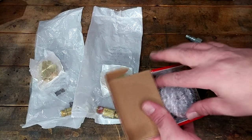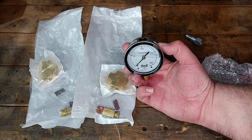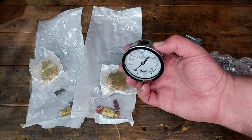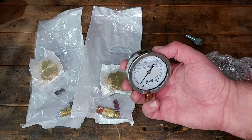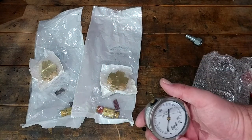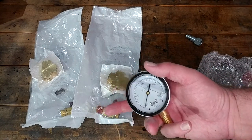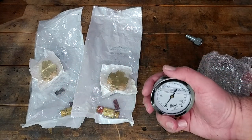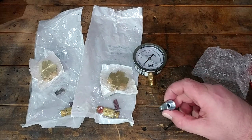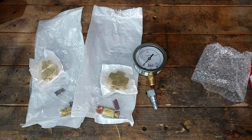The first thing I'm going to do is verify that our pressure gauge isn't lying to me. To do that I've got this completely swanky glycol-filled stainless steel gauge — 100% not necessary, but cheap stuff isn't cool and cool stuff isn't cheap. So if we're going to do it, we're going to do it. This one's good up to 200 psi, as is all this stuff. In the future when I upgrade air compressors, all this will live along with me and continue to be safety and information equipment. The first thing I'm going to do is put that air fitting on that gauge, plug it in, and see if this gauge and the one on the tank agree with each other. So I've done that.